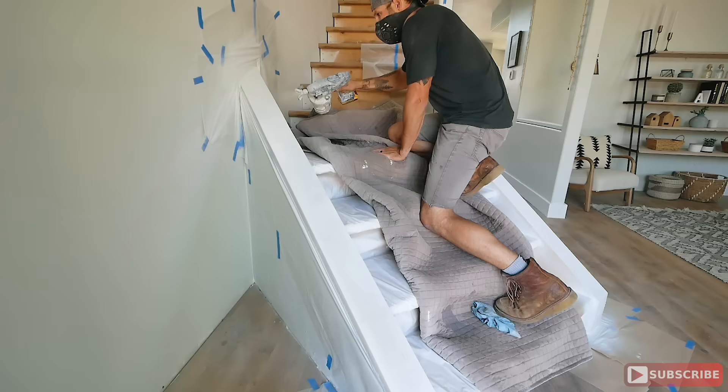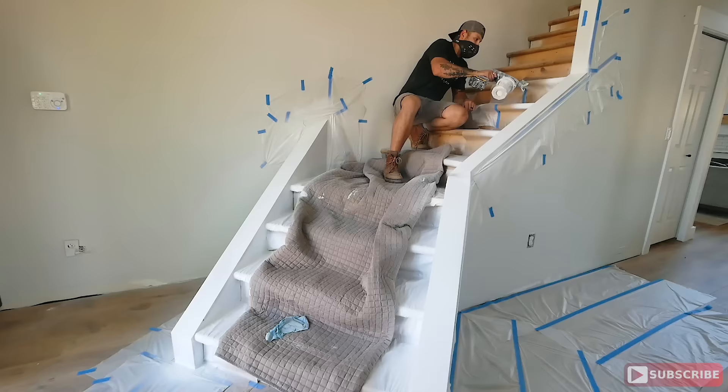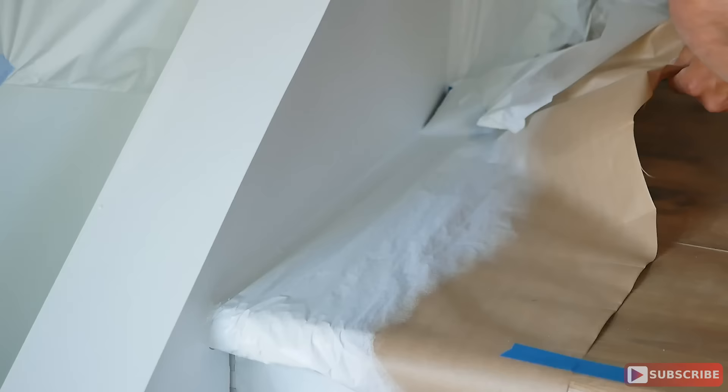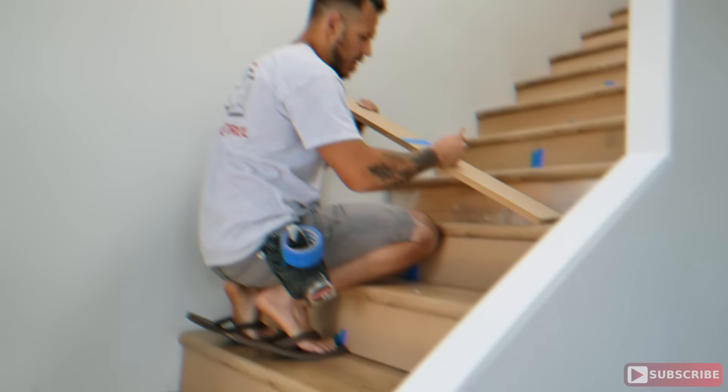When it comes to achieving a crisp painting line, I got a tip from a professional painter: mask it off first, put a bead of paintable caulk down, spread it with your finger, then put a fresh coat of paint. Before the caulk or paint dries, carefully take the tape off and you'll see a crisp line. The downfall is if you let it dry too long, the line will look jagged. That's a little tip from him — hopefully it'll help you.